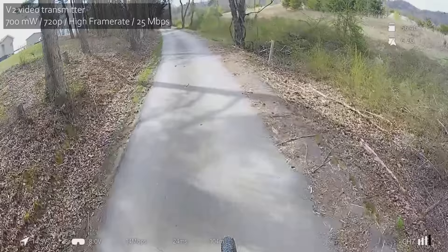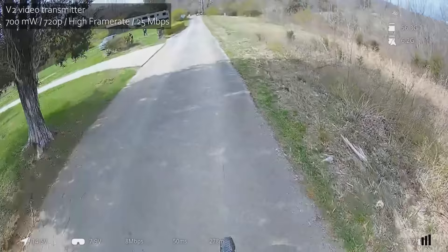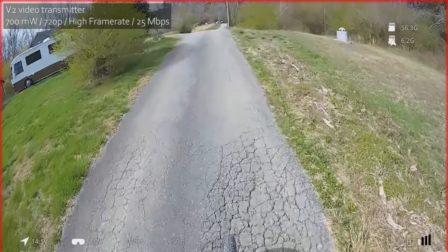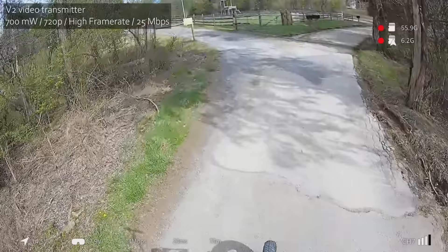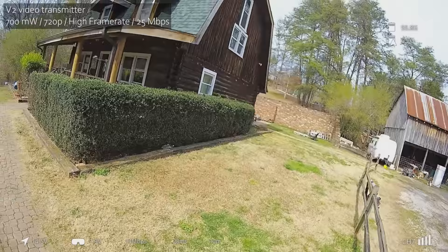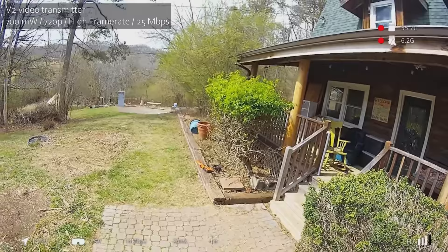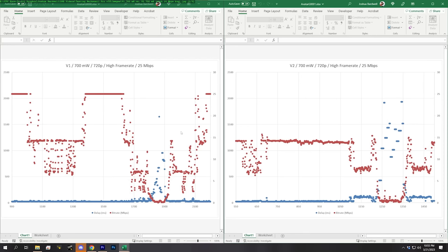As we come around this curve — the hardest part — we should see some drop in the bitrate. Dropping down to zero and then back up again — eight, seven, eight. It kind of seems like the V2 video transmitter is doing a little better job of holding on through this part of the run. Let's see what happens as I come up the driveway. Why is it just staying at 14? I should absolutely be at 25 here. I have no idea why this is happening. I'm literally going to walk up on the porch — nope. That's obviously not what's supposed to happen. Maybe we have found a bug. Well, let's not just rely on subjective opinion to see which is better. Let's look at charts.